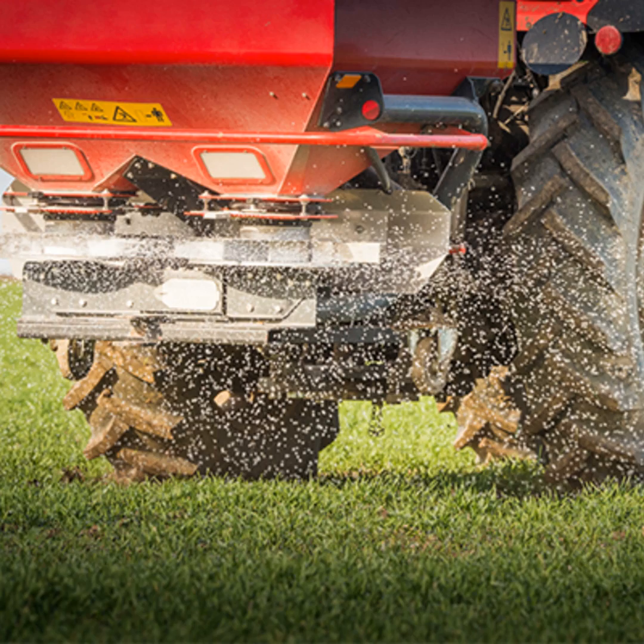Probably the most important item on the whole fertilizer spreader — and definitely the most neglected — is the actual vane itself. It's a wearing part. Over time you'll get ripples on it, and eventually holes worn in it. I've actually seen over an inch or more missing off the end of the vanes. That will have a detrimental effect on the spread pattern. A set of vanes for a conventional spreader is around 300 euros — it's only six inches of steel, but it's the piece of steel that does all the work on the spreader.